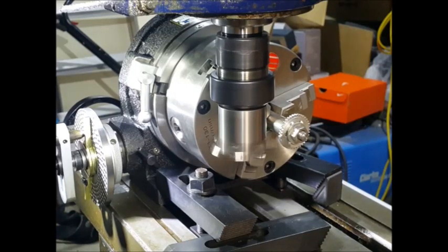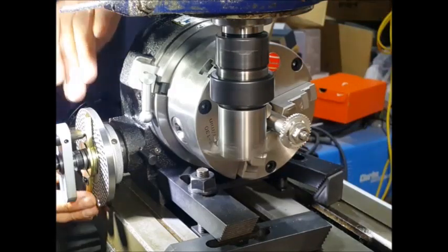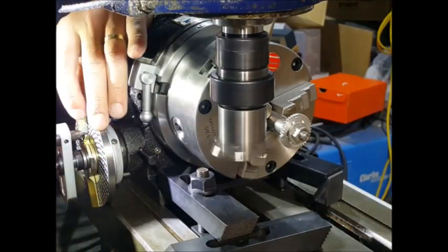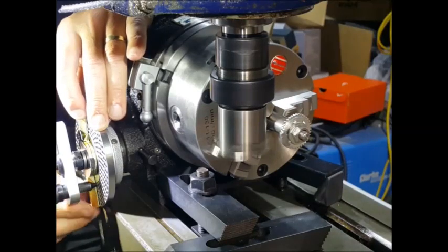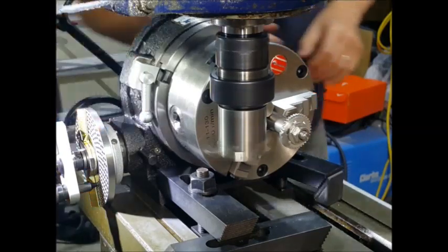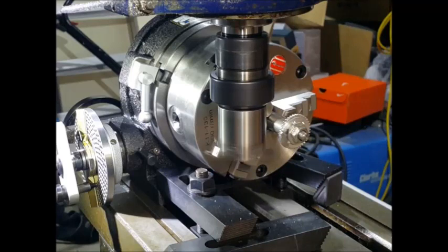This is where things start to go wrong. The brazing of the gear with the low temperature aluminium, there's obviously something in that which I didn't like, because when I was cutting it with the fly cutter, which is an interrupted cut, it just didn't like it. It was chipping rather than cutting. When you look at the makeup of the brazing itself, it finishes up being like a cast type looking material. So instead of a nice smooth cut, it was taking chunks out and leaving a rough finish. So that wasn't going to be any good.